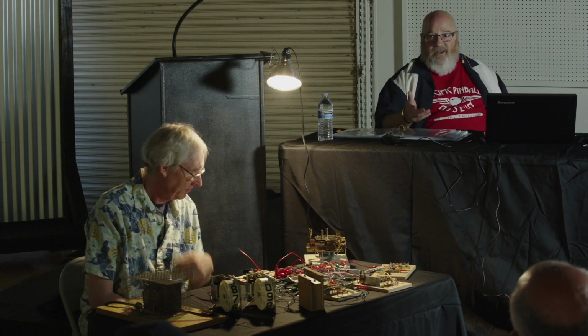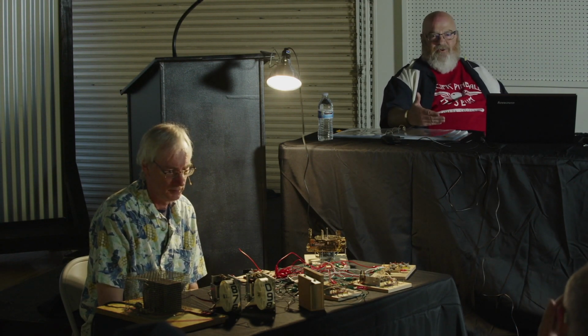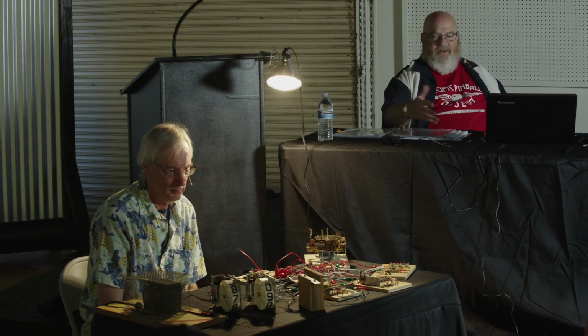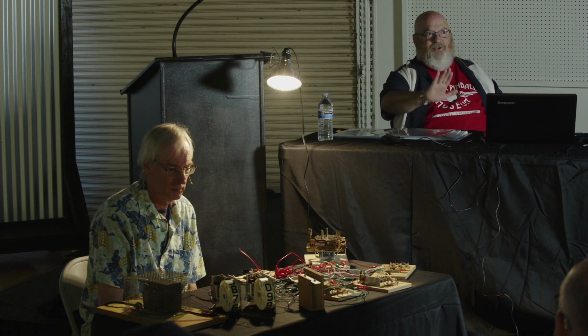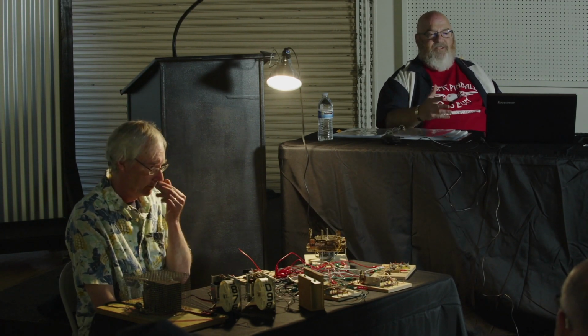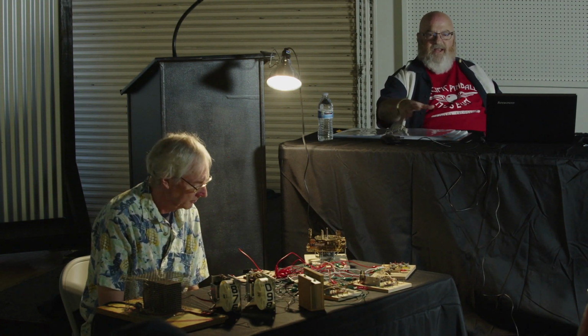And if your score reel has added friction in it because it hasn't been serviced in years, or the grease has dried up, or sometimes the spring just can't overcome the switches the same way it used to. You have to adjust these switches. The amount of effort the spring has to overcome to get to closing the 9 switch is a lot of work, and so it often is hanging up. You can see it hanging up, like the 8 is still showing and it can't quite get to 9. It has to do with the mechanics of mostly Gottlieb score reels, getting that 9 switch closed.